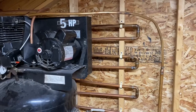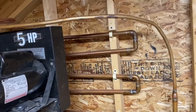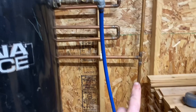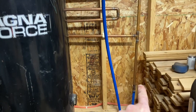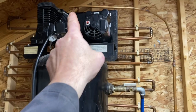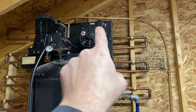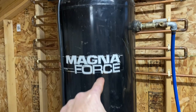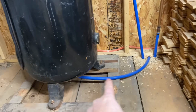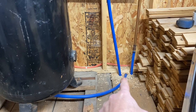Overall I love it. The only problem is I expected the majority of the water to flow back down the cooling system and drain out the right-hand PEX line down to the main floor. The theory being: hot air comes out of the compressor, goes down, turns the corner, flows up, condenses and cools out, flows back down and drops out that way — so the dry air comes out of the top, goes into the tank, and the tank stays cool and dry. I do have a drain line to catch any residual moisture in the tank. What I'm finding is 95% of the water I drain is coming out of that line, not the cooling system line.